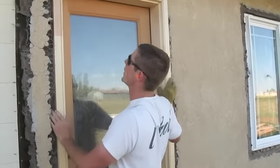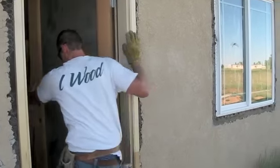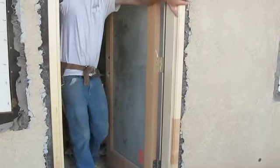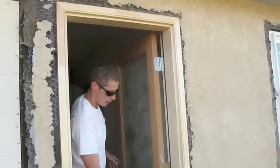This is why you frame it out a little bit bigger too — you don't want it to fit perfect in there. It actually just makes it very hard to install. You want to pull it tight up against the wall, and if you kick the door open it keeps it from falling out.